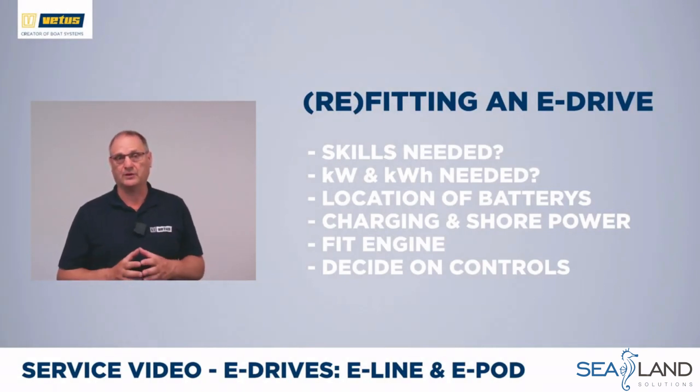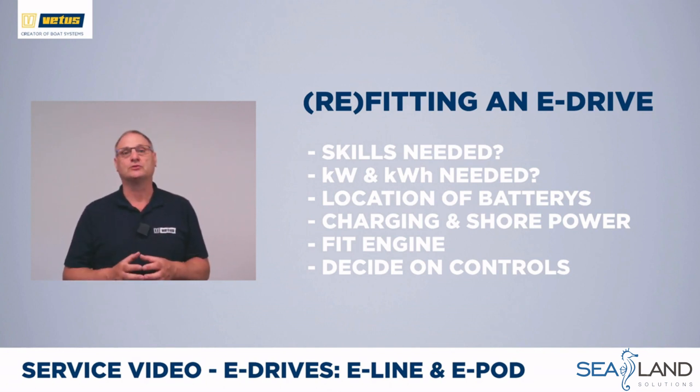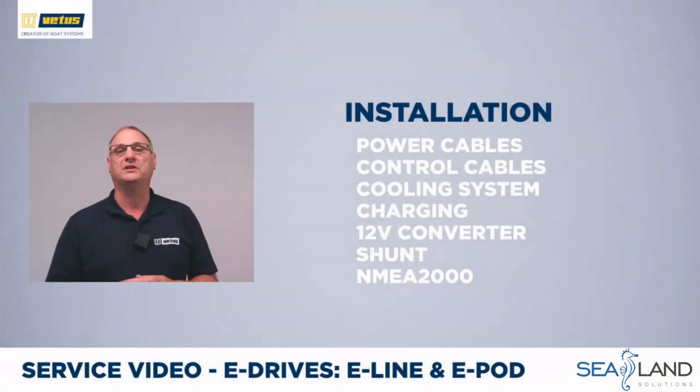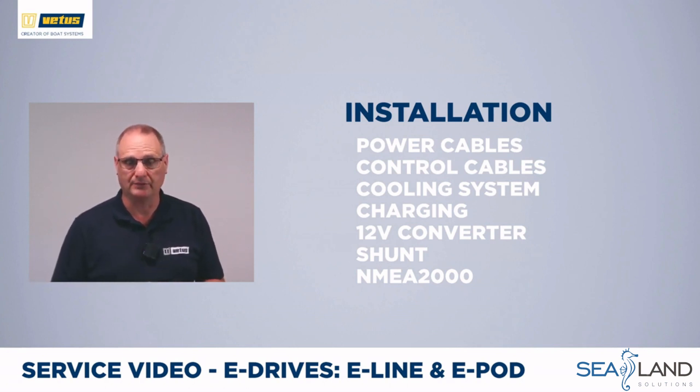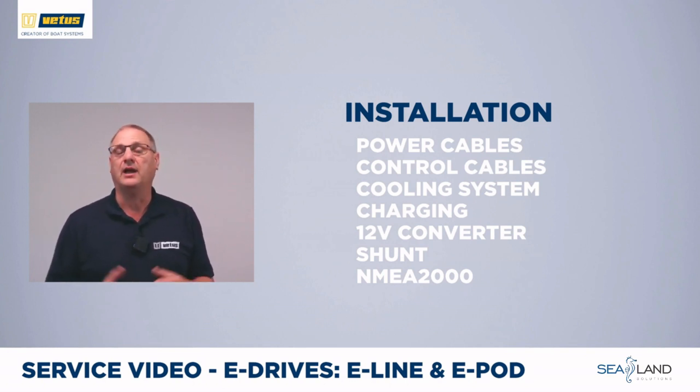Installation of an e-drive is very straightforward — no exhaust hoses, no water lock, no cooling lines. It is the engine, control cables, the V-CAN network, and high-power battery cables from battery to motor. Consider where to put the batteries and how to charge them; chargers are box-standard, you install them and hook up to shore power and batteries. Decide which controls to use: basic controls are plug and play on the V-CAN network, but the advanced monitoring system requires a shunt as well. The focal point of installation is transporting energy from batteries to the drive — keep those cables as short and thick as possible to minimise electrical losses. If you lack tooling for heavy-gauge wire, any forklift or battery supplier will make them on demand.